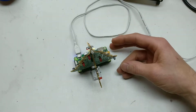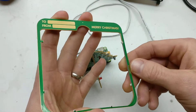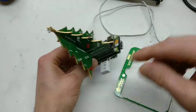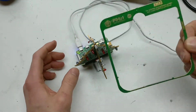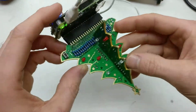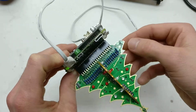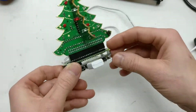There's a few other things I'd like to mention. I stupidly took my board out of the frame before looking at the instructions, and the instructions tell you to keep it in, because there are places for where the headers go — it makes it a lot easier to add the headers. These middle bits tell you where to put the headers. You can look at the pictures, it takes a little bit longer, but try and keep it in whilst you're doing it. Also, if you are going to add a button like me, you also need to bridge where your resistors go at the back. At first I put it on and I was like, why is my button not working? And then I realised I didn't bridge the resistor. You can just use a lead off one of the LEDs when you chop it off — bend it over, stick it in, and that's it.